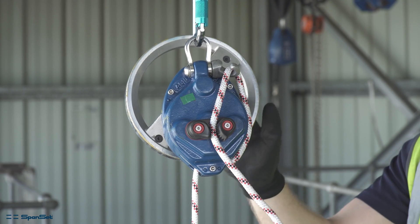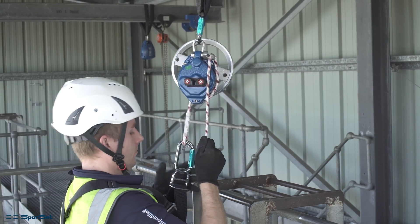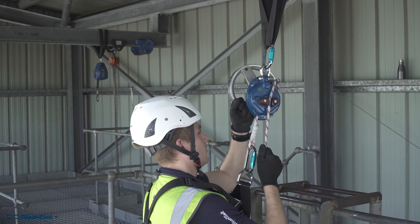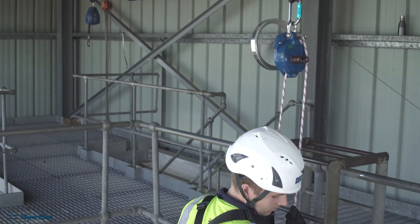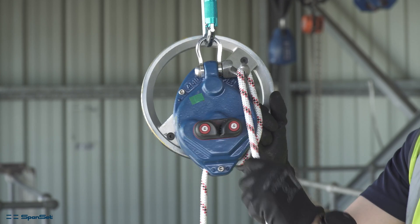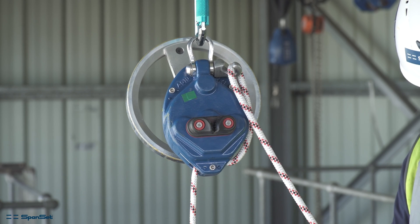To take the rope out of the locking cam, it will be necessary to hold onto the control wheel with one hand before pulling the rope out of the locking cleat using the other hand. Before releasing grip of the control wheel, be sure that the slack side of the rope is still over the hook and the tail end of the rope is firmly held to allow full control of the descent. If you need to stop and go hands-free or use the lift mechanism, place the rope back into the locking cam cleat.